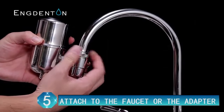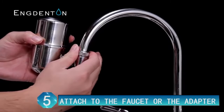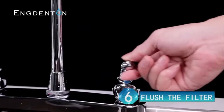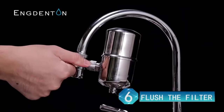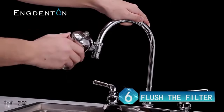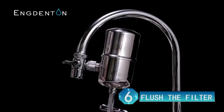Screw the mounting nut on the faucet or on the adapter. Do screw tightly. Everything is ready now. Turn on the faucet. Switch the valve to get tap water or purified water. Adjust the angle as you wish. Please do flush the filter for 1 minute before using. Now you can get clean and crisp water at any time.